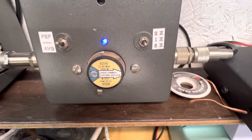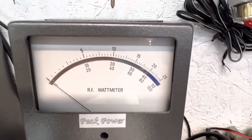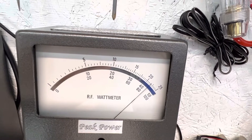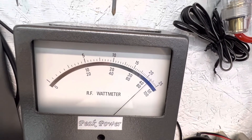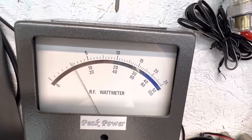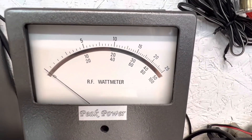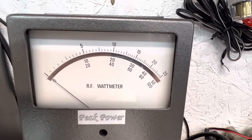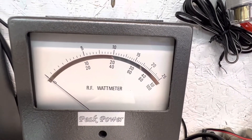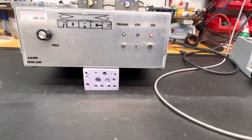Let's go over here to peak — 1000 watt slug. That bottom scale, remember before it was doing about 650. Low audio — hello. So peaking over 900 but she's talking right at around 900 watts. So not quite a 300 watt increase, but we'll take it — 50% increase. Heck yeah.